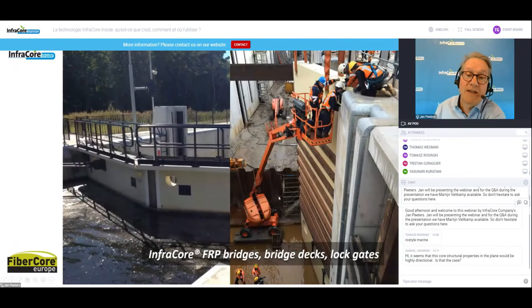Even bigger — 29 meters over the diagonal — another bridge deck for 60-ton traffic. Lock gates. These are big lock gates, actually the biggest lock gates in the world at the moment. Look at the people down there for scale — this is a very big door, 30 meters high. Here you can see the operation; the water level being contained is something like 8 to 9 meters.